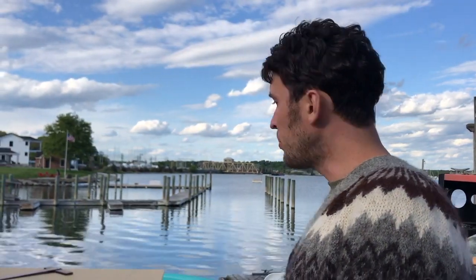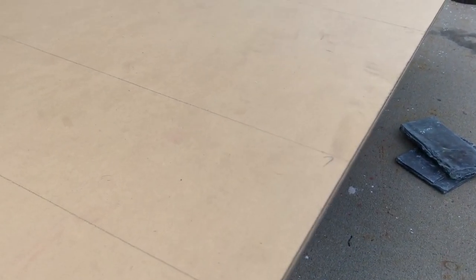If it didn't line up, I would not feel comfortable doing that, because as you extend the length of a boat, the proportions of a lot of things tend to change. Your displacement to waterline length ratio changes, all sorts of ratios change, just because of the way that things that are buoyant behave differently as they increase in size. But given how well everything has lined up, this is, I think, what I'm going with. And this is what it looks like.